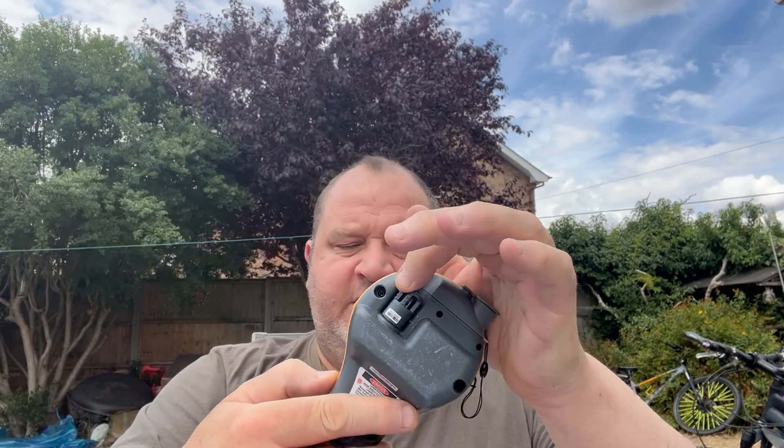The MMS2 is a far more evolved and complicated bit of kit. It can tell you room temperature, room humidity, building material moisture, surface moisture, and surface temperature. It has a hygrometer on the back that can tell you your relative humidity, the condensation risk, your dew point, and when there's a risk of obtaining condensation.